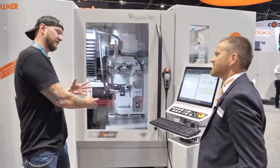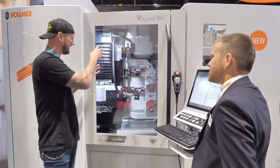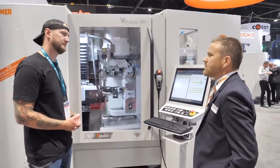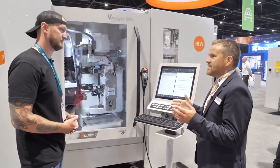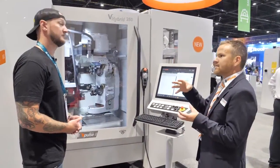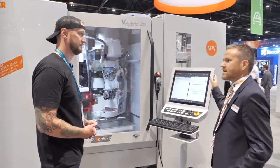For those not so familiar with tool grinding, what's the advantage to using grinding versus EDM, and when do you use each? For grinding, most materials are carbide. For eroding, we're working with PCD. But there are really a lot of tools in the market which have both materials combined, and especially for those kinds of tools, we use this machine to combine both processes in one single setup.